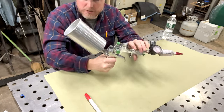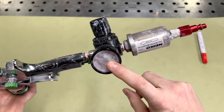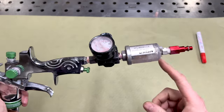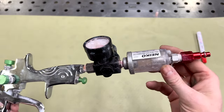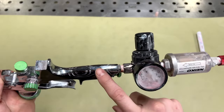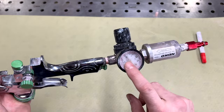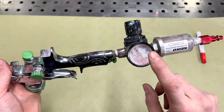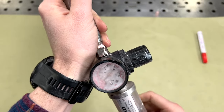If you have one of these old cup guns laying around, you can buy the nozzle. It's important to note here that I have a separate regulator on here, as well as a Nikko oil and water separator. The air compressor that I use is not very good — not a high quality air compressor — so I want to make sure that I have at least a secondary air water separator. The purpose of the regulator is so that I have fine control at the gun, where I don't have to run back to the compressor to dial it up or dial it back. Whatever my compressor is set at — probably 120 to 150 — I can adjust that right here. You pull the thing out, you turn it in and out, and you lock it back down, and everything is good to go.